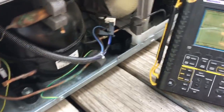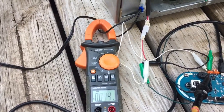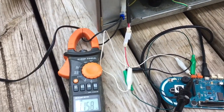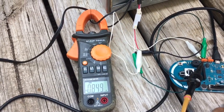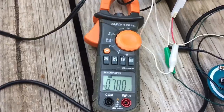The first one, I'm going to start on low speed. I just had it running so it may not want to start here. That was its first pulse, second pulse and it's going. This will get down to probably about 7.7 or 7.8 amps at 52.8 hertz.